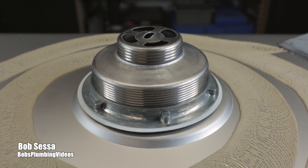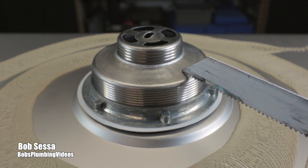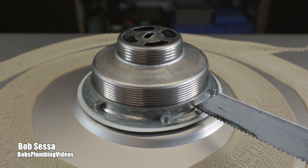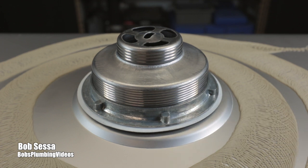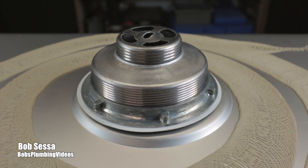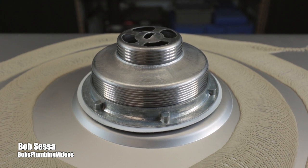For those with experience using power tools: I've used a reciprocating saw making a plunge cut straight down through the strainer and into the nut, stopping short of penetrating the flat portion so we don't nick the sink. I use a 12 inch blade with about 24 teeth per inch, very carefully and slowly from outside the cabinet. After making that cut I come in and pop the nut off. However, I don't advocate a homeowner or DIYer doing this with a reciprocating saw because it doesn't take much to destroy the sink.